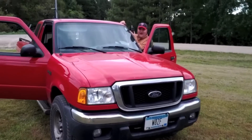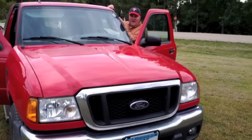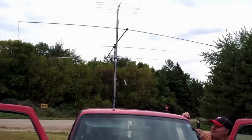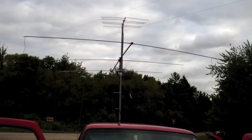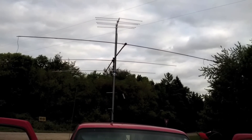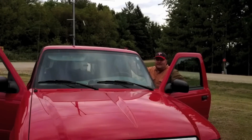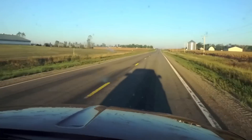We're up here in Echo Nancy 2-5. We just lashed the six-meter antenna onto the two-meter 440 beam. SWR is saying 1.1 to 1. So we're actually going to try to rove with this — probably not too fast — but we're going to at least try it so we can keep on the air and keep on moving. Let's hope to make a few contacts.